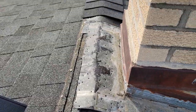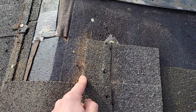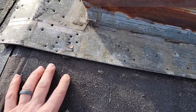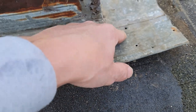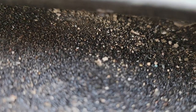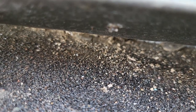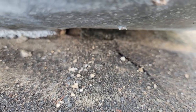Some fine quality work right here — cut it back barely covering it. I just can't wait to see the pipe boot repair I've got to do on the other side. I mean, what are people thinking when water flows around this? These nail holes right here — I bet if I look in here I can get that up high enough. There it is — you can see all the water coming in right there at that nail, the dirty water trail, right where that lines up on the ice and water. You know what to do — if you like it, give it a thumbs up, and until next time, be safe. We'll see you on the next video.